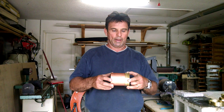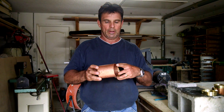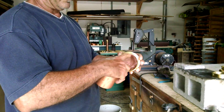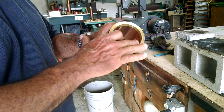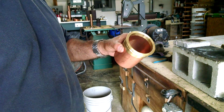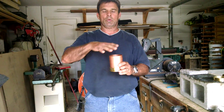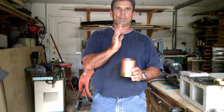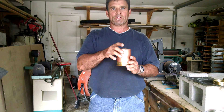To fasten these sections on here, as I was saying about that chop saw and making a square cut on these pipes — if you look inside these ferrules, there's a shoulder cut that the CNC machine has cut out, and this actually fits right on top. You want the pipe to seat properly and be square, because when you start to build your tower up, if they're not square, it's going to start leaning to one side or the other.